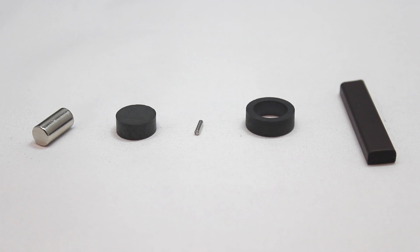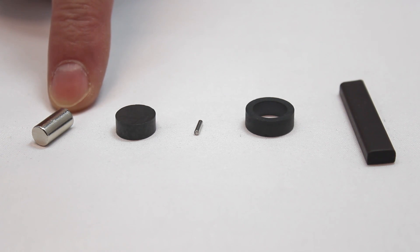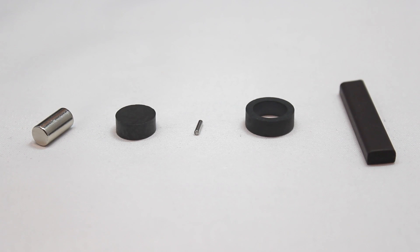Let's take a look at the kinds of magnets that are good for use with reed switches. Google magnets and you'll find a bewildering array of different types. Here's a rare earth magnet — a so-called neodymium iron boron magnet. These are small, powerful, and relatively expensive, but if the application space is tight, you might want to choose that kind of magnet.